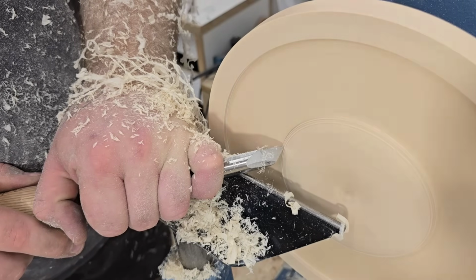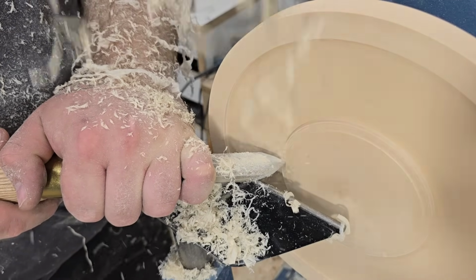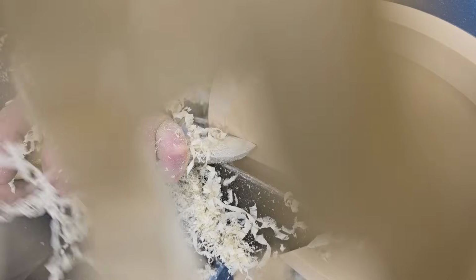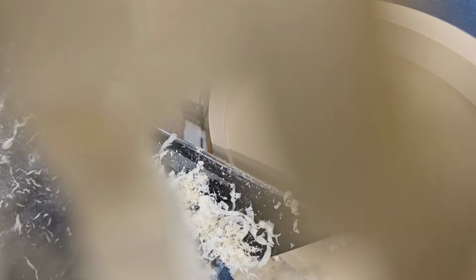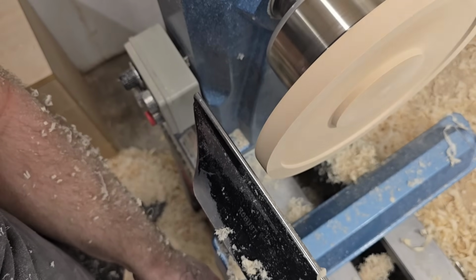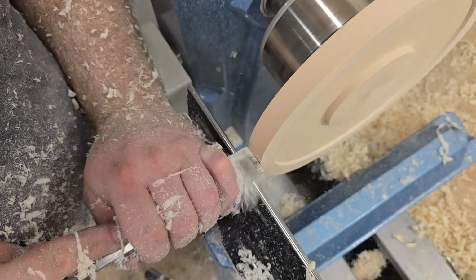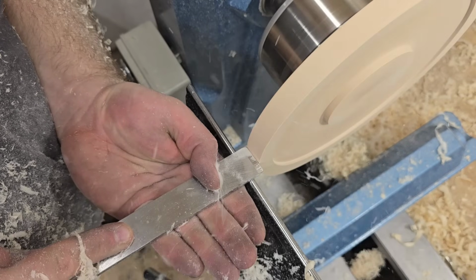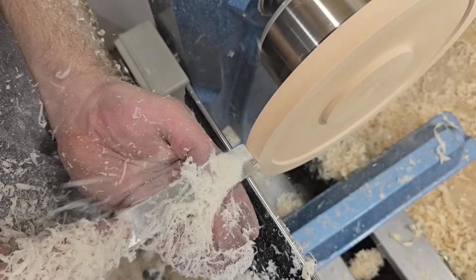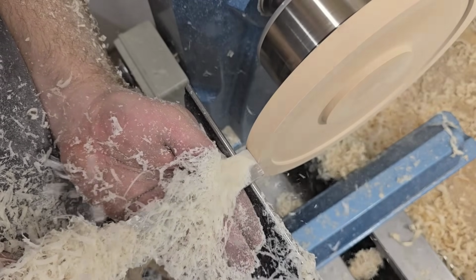You can cut with it. Let's say a tenon. You can use it flat as well. Again, works lovely. But also, get the shavings off the camera. Now here on the end grain, side grain portion, negative rake scraper, you can see now works a lot more aggressively with the pull burr, but since it's a negative scraper, it won't fight you back, and it will leave a really nice finish.